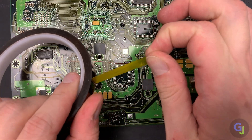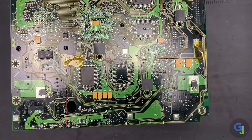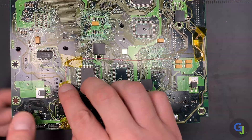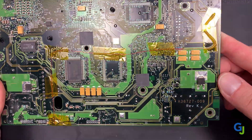I'm using Kapton tape for this since it's meant for use with electronics. I like to go over each of the bends first and then cover in between so there's nothing hanging loose that can be snagged during reassembly. If you have multiple broken traces it may be a good idea to use different wire colors or route the wires in different locations so they don't touch or rub after this.